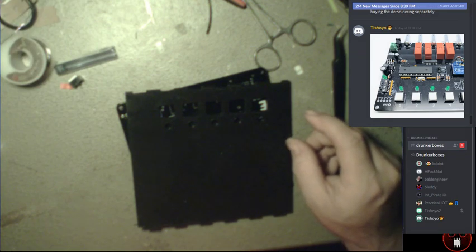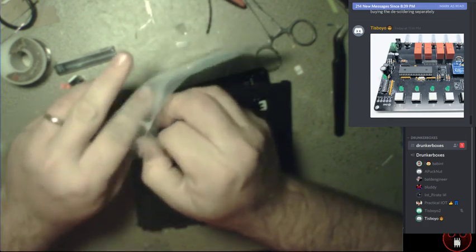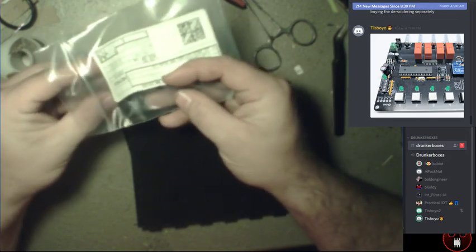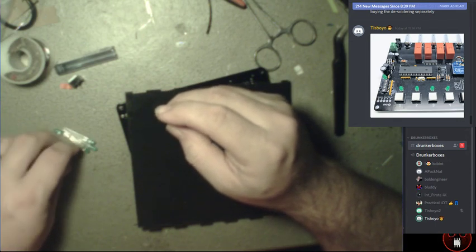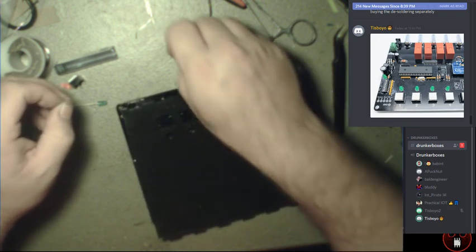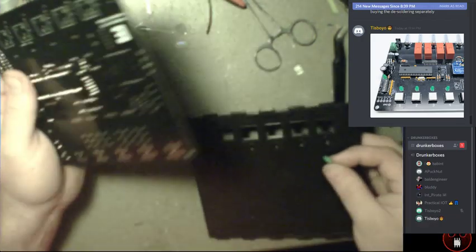All right. Lost my LEDs again. I mean, it's got RS 485 as well. So they really designed it so you could put it outside, close to where your antennas are, so that you could have one high-quality feed line running outside instead of 4 of them running into the house, because LMR 400 is expensive.